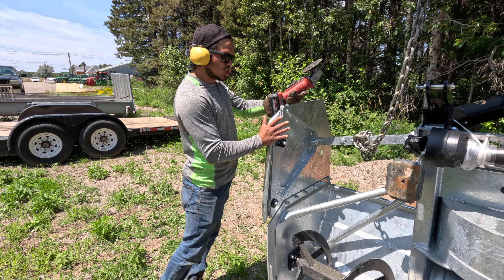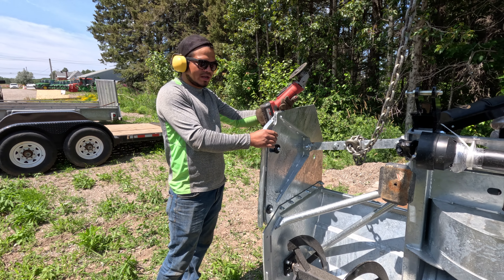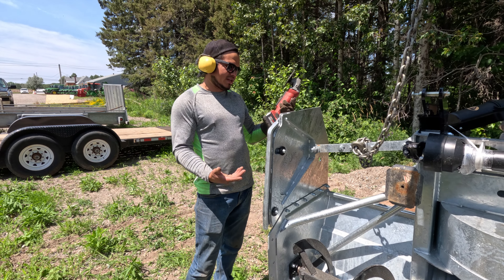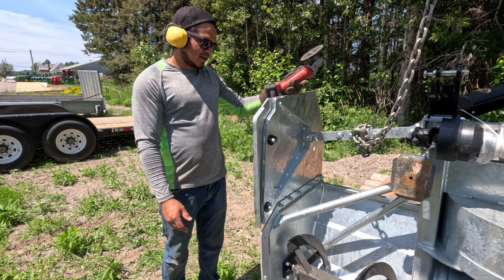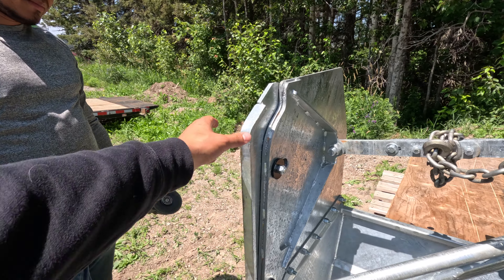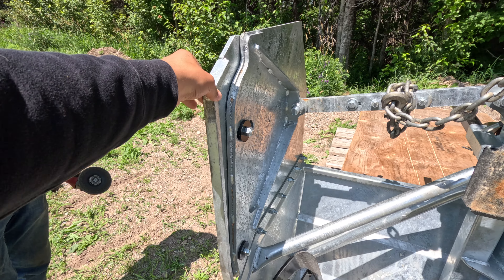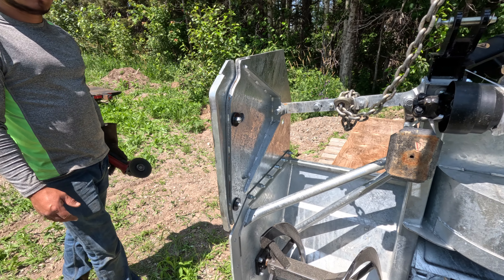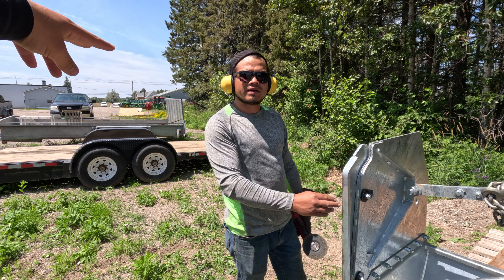So that's a big issue we had with the Norman hybrid 92s and 82s — the skid shoes not only freeze up and lock up, they also leave nasty black marks all over the customer's driveway. And the wind rolls too — when they freeze up and stop and won't go down, when you're going with your blower the wind rolls in there. It was not fun because then what's the purpose of buying it, right? I gotta say, Pronovos has made an excellent design here. There's a lot of play in it — it's a little bit loose, and it's supposed to be so that it can move freely and not get gummed up and freeze.